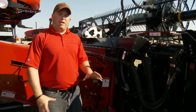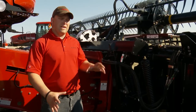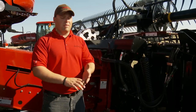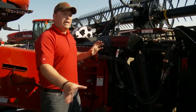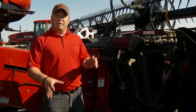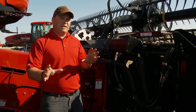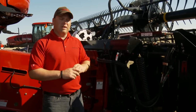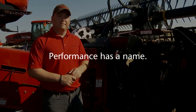That's a pretty basic walk around to give you some features and benefits on the FD70. Keep in mind there are a lot of similarities — your drapers, C-shaped cutter bar, pickup reel — all of that is common to the D60. Much the same again on the D50: the drapers are a little bit different, the reel is basically the same idea but lighter duty drive, but other than that much the same product.